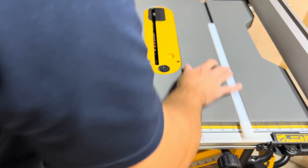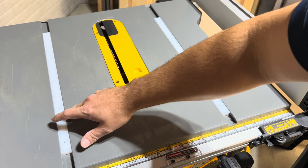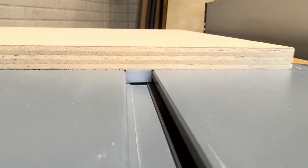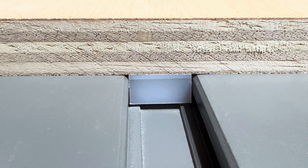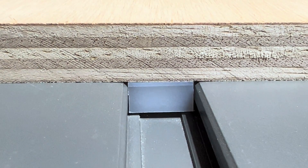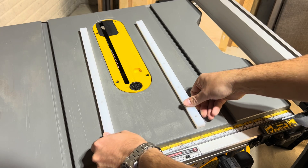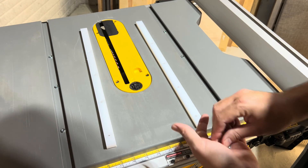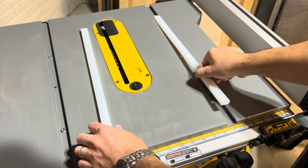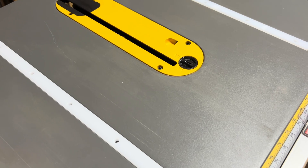The runners should fit in the miter slots with just enough room to slide forward and back without side to side motion. The slides should sit just shallow of the table saw top so when installed on the sled they don't drag on the bottom of the miter slots. If you decide to use wood, avoid soft lumber such as pine and go with a harder type to hold up longer. Before installing the sliders I added nuts underneath — coins or washers can also be used — to allow the sliders to sit slightly above the bottom of the miter slots.